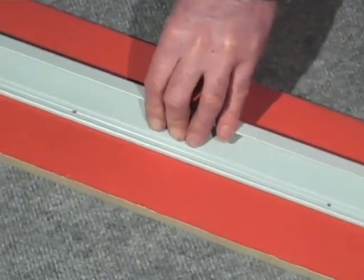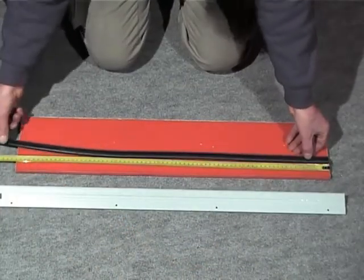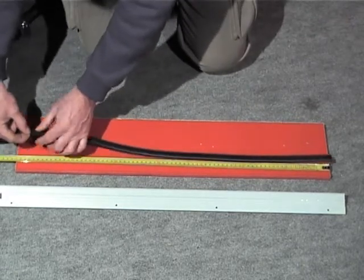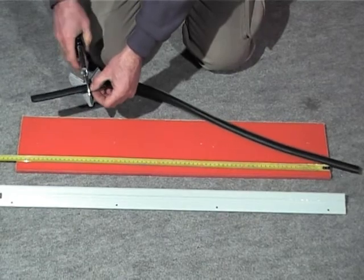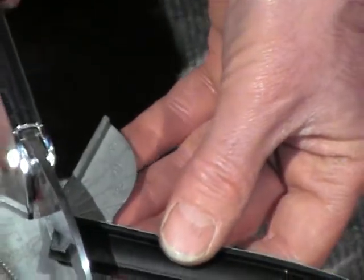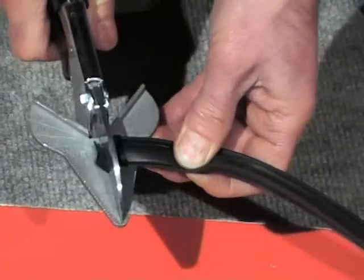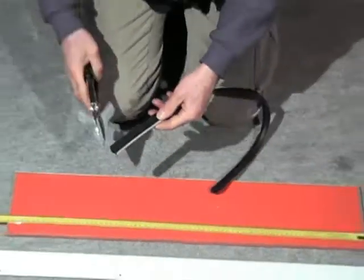Now you only need to prepare your drip channel with its top seal for fixing onto your header. Remove the plastic caps as well as the strip seal and drill. Adjust your top seal by starting to cut it on one side at an angle of 60 degrees. Then measure and cut it to the dimension of the width of the outside track of your shutter, minus two times the thickness of the tracks – in other words, 34 millimetres. Centre the seal on your drip channel and stick it onto the back.